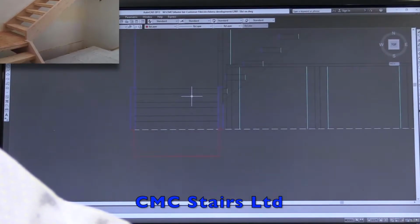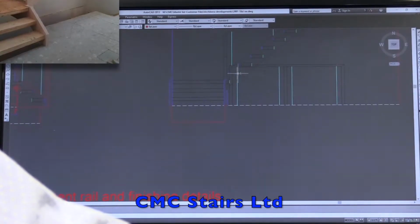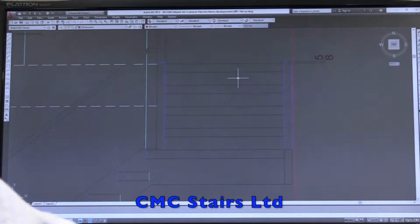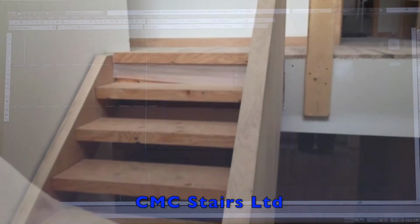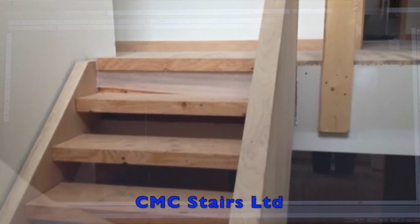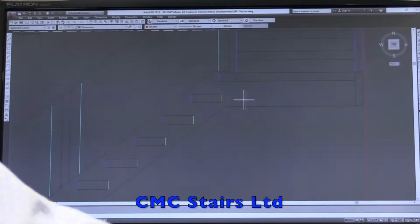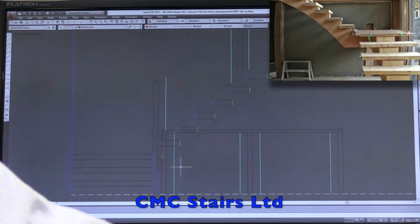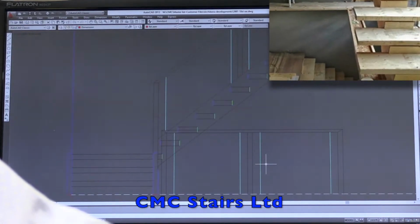When I do an open rise stair, I like to make as many open rises as I can possibly do in that staircase, except for the connection points of where they connect to the floors. So this first step on the second floor would be closed. You couldn't see through it. All the rest are going to be visually through. And again, you turn the corner and they're open again. This client has a grooved glass rail system with no clips, no metal hardware, all in wood.